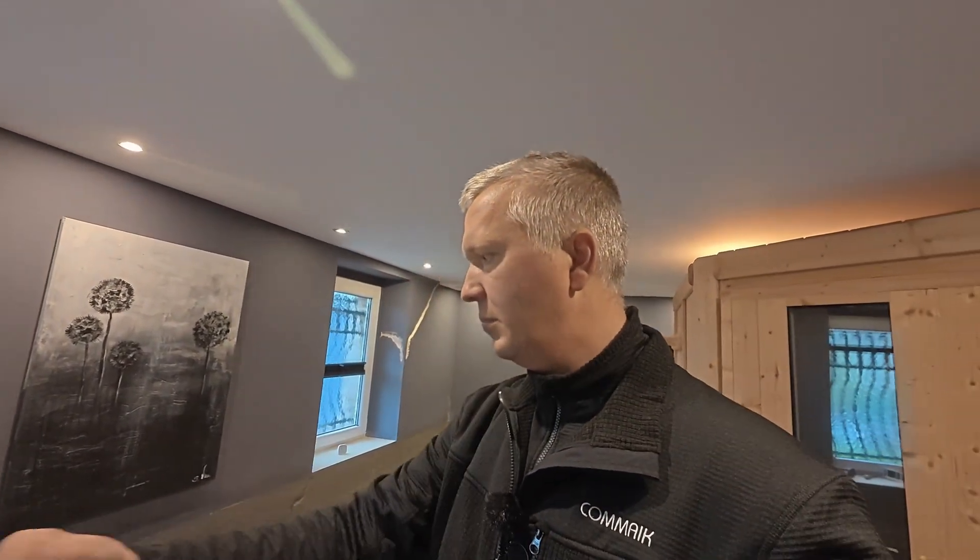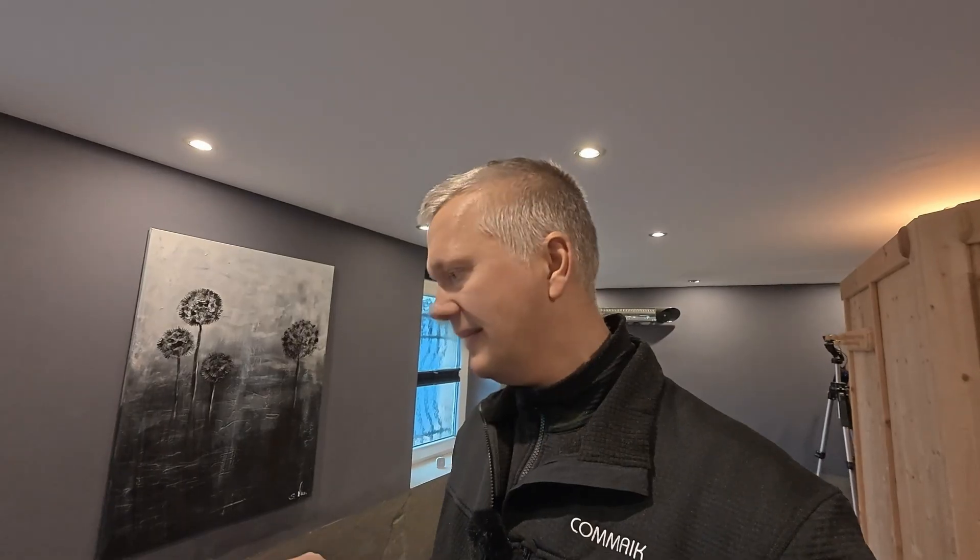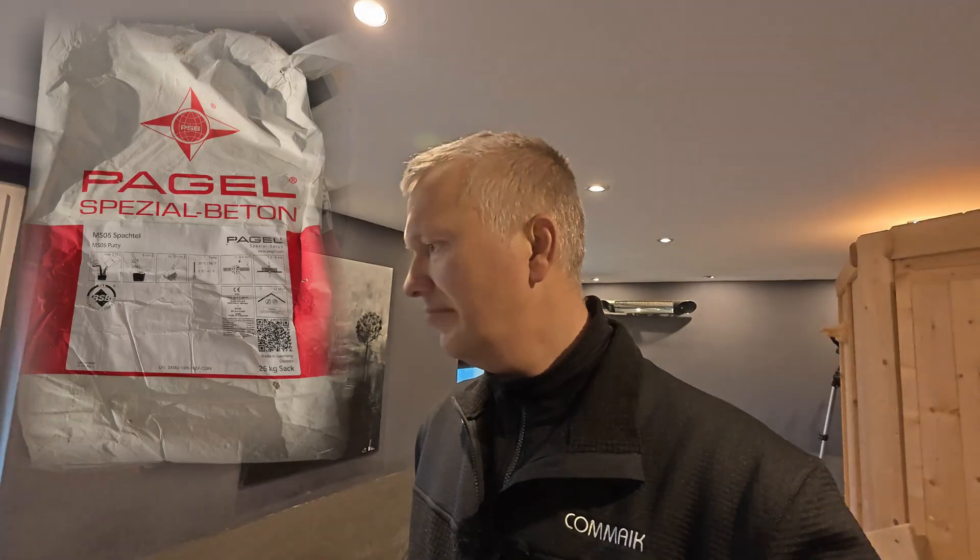Now I'm going to prepare the surface of this wall, because this heating film will be embedded into the wall with filler. If you have a drywall or a dry area, you can use regular gypsum plaster — simply pre-coat the wall with a small notch trowel, press the film in, and smooth it out nicely again with a plastic trowel. It's important that you don't damage the fleece, or at least not too much, because otherwise you'll have spots where it won't work anymore. Unfortunately it's not so simple for me, because this area is a wet room and I'd prefer not to work with gypsum here. That's why I got a cement-based filler — significantly more expensive, but I hope the extra effort is worth it.